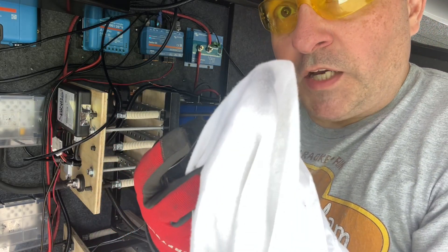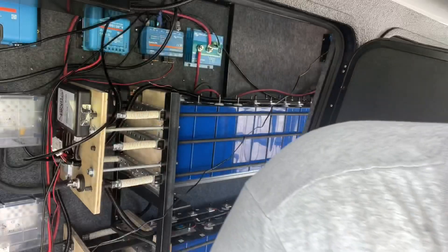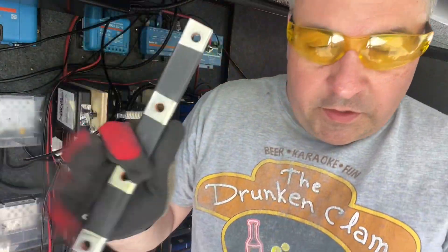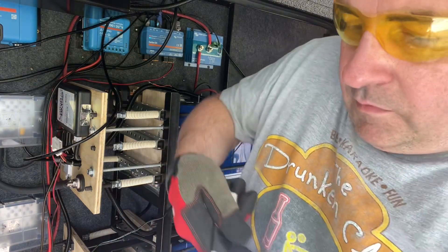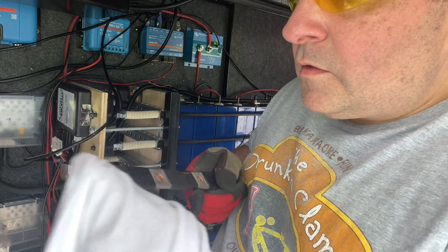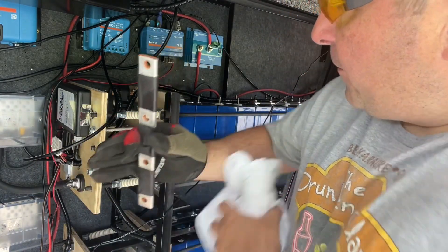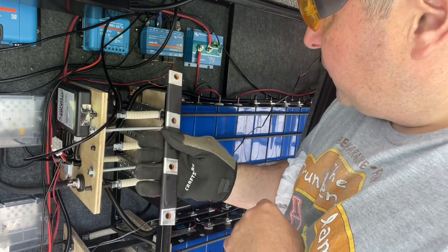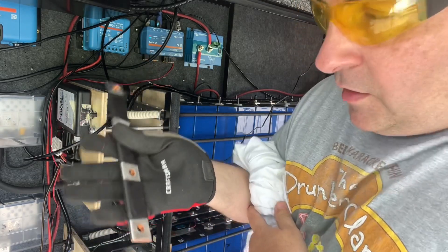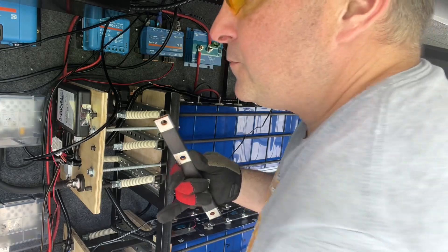What you see on the rag isn't really dirt — it's aluminum dust from the polishing, so it's good to get that off. Now let's do the bus bar. These are tinned bus bars. If they were pure copper you'd have an oxidation problem between aluminum and copper, and you'd want to use an antioxidant. Since these are tin, I don't have that problem. I'll do the same cleaning on the other bus bars and then put it all back together and fire it up.